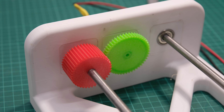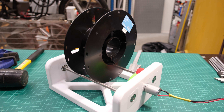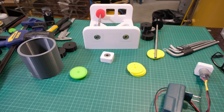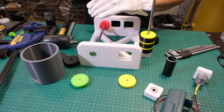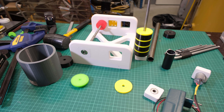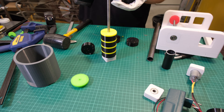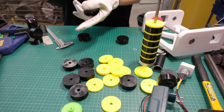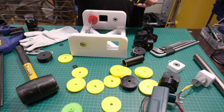The sprocket on the motor shaft slipped under load, so I designed a new version of the sprocket. Ideally this should be belt driven, but as I did not have those parts, I continued with sprockets. Relying only on the axles, the part rotated too slowly and lacked sufficient grip, so I also printed 50mm rollers, with every other one made from flexible filament in yellow. The idea was to gain more traction, as round plastic containers are slippery. I designed the rollers and forgot that if you want an 8mm hole it needs to be slightly larger — about 8.1mm. As a result, all the rollers were too tight, so I hammered them into place using a piece of pipe.